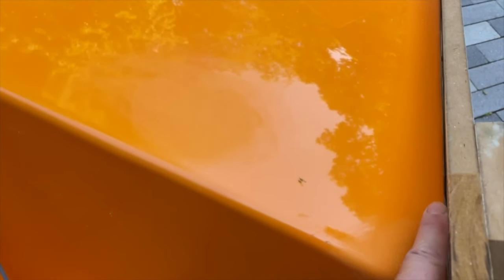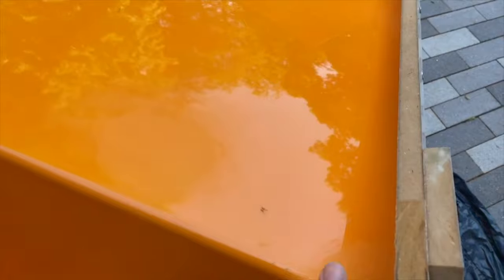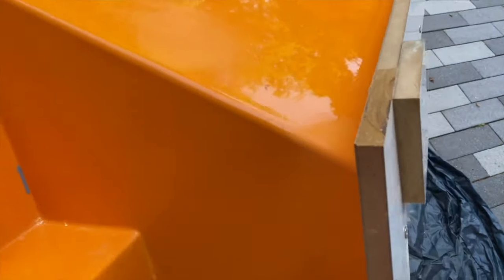a flange that we can then connect to the other parts of the mould. So this will then connect to the front part of the mould. And we've got these gaps here. We'll use plasticine as before. I mean, this is all hidden within the mould anyway, so you won't actually see this, but so plasticine down here, and we'll plasticine up these corners here.